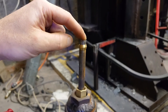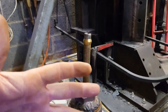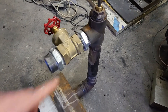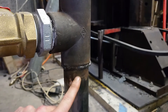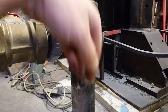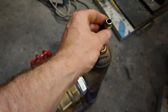The torch tip has been drilled out to 1.4mm, which is quite large but then again this is a large burner. The pipe extends past this elbow to about here, to make sure you've got a nice swirling effect for your air - it grabs that and pushes it down into there.